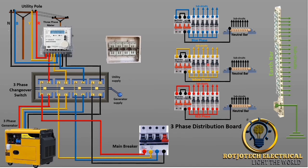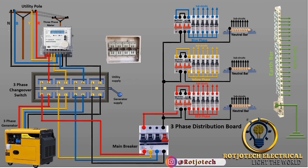You can see that this board has three phases — red phase, yellow phase, and blue phase separately. That's why we need to connect them one after the other. First, we are going to connect neutral to supply all the phases at once. And then we are going to connect each phase after the other — first the red phase, followed by yellow phase, and lastly blue phase.